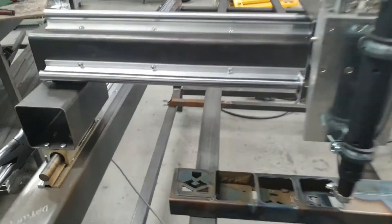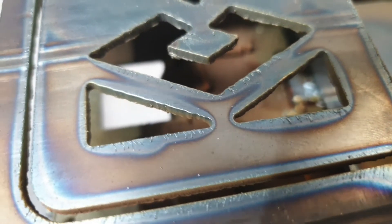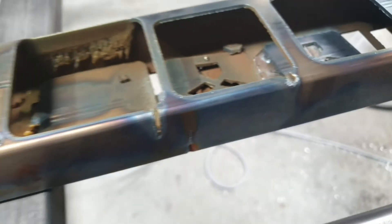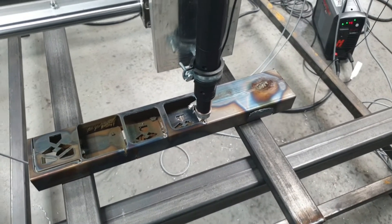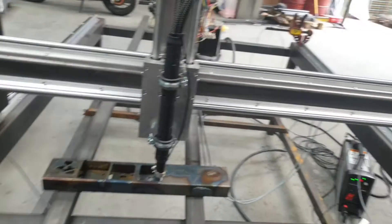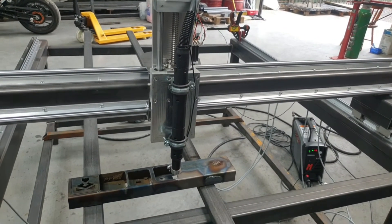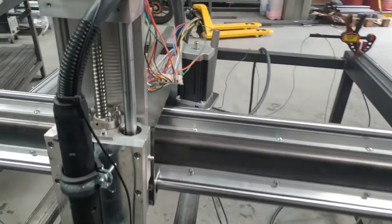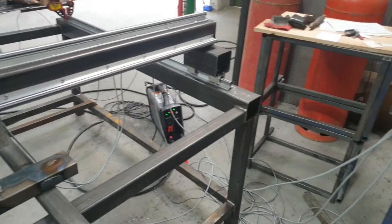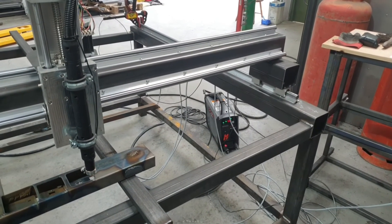It is really obvious. The reason I know it's that motor is because this is a cut I did earlier and it's not too bad. You can see a little bit of wiggle on there, but as you get further down the end that hasn't got the motor, that wiggle gets progressively worse. We need to stop that, and the best way is to mount the motor — so get the drill out, get the taps out. Although it may not seem it, I'm trying to do it as professionally as possible. Block connectors will not be used, most bits of tape will not be used — I just want to make sure that it's cutting what it should be cutting and how it's meant to be cutting it, and make sure that everything works. There's no point spending hours on stuff you're not sure works and then having to make modifications and changes.